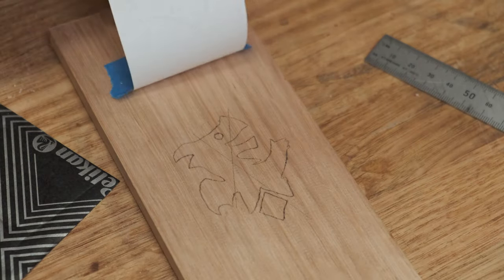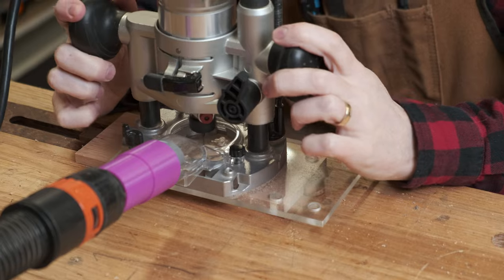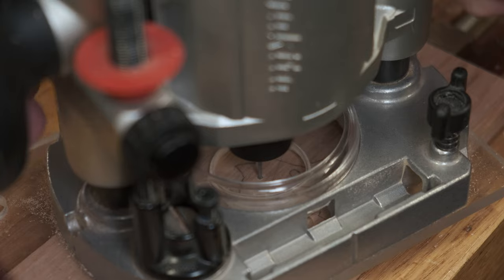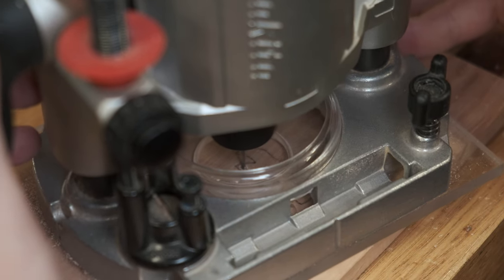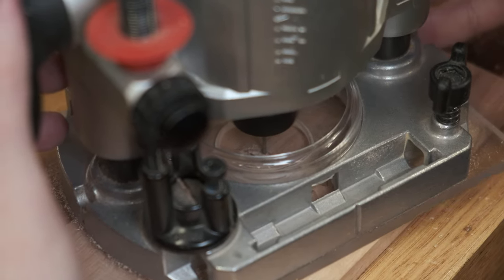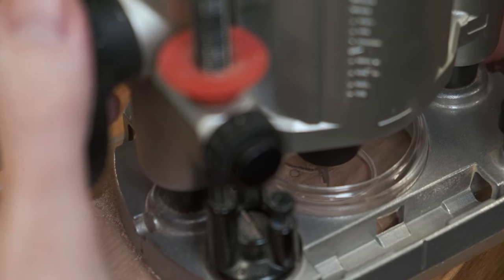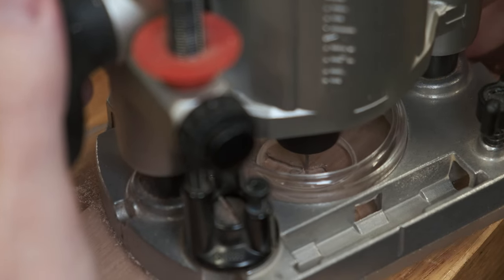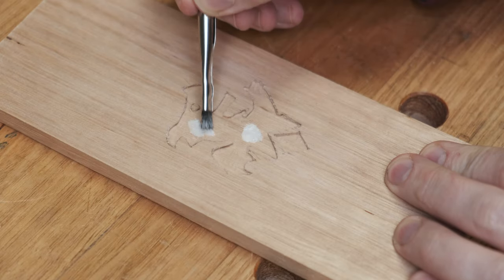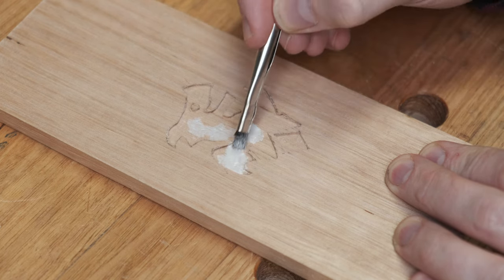Once it's done it's pretty clear. The second step is to cut out the pocket for the stones to go into. Depending on the design this can be tedious with a 1/8th inch or smaller bit. The depth will depend on the size of stones you're using. Small bits like this aren't too grabby so they're easy to freehand rout. A down-cut spiral bit is the best choice, but any straight bit will work. With the pocket cut, it's sealed with some shellac — I only have tinted primer shellac at the moment, but it will do the job.